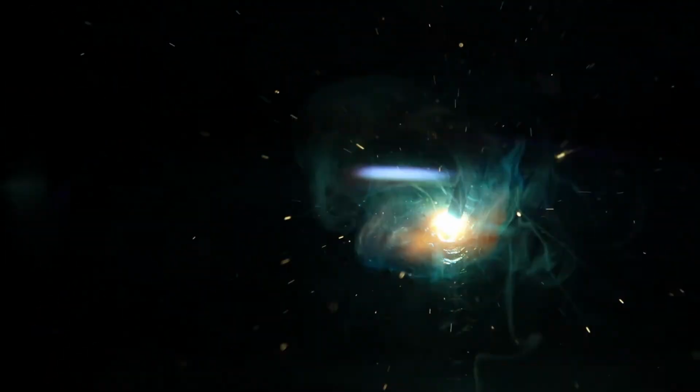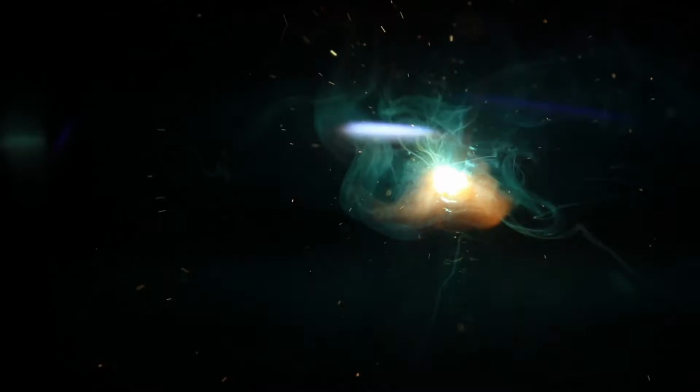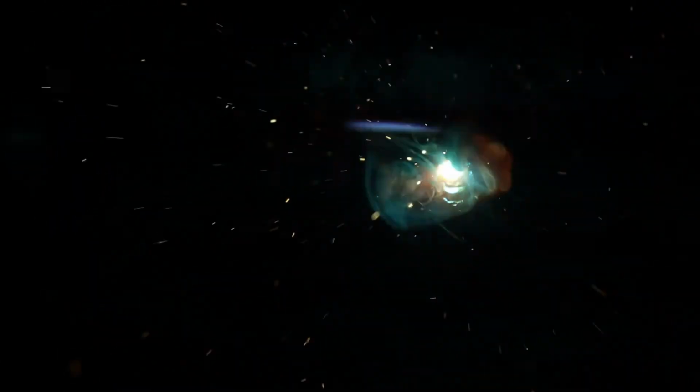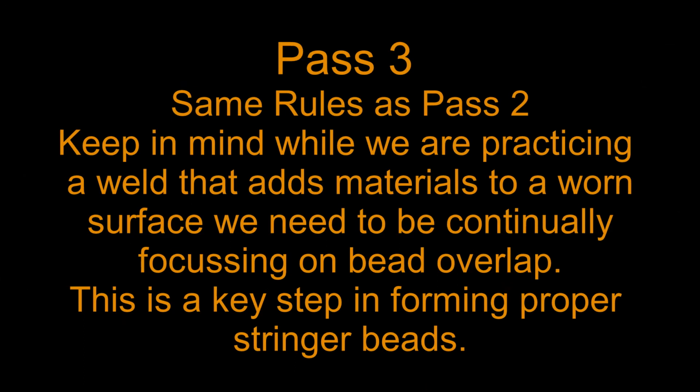Notice that the electrode again is covering about 50% of the previous pass. This little alternating current machine, we had some, not difficulty with it, but we were really pushing the capabilities of that machine as far as the duty cycle goes. And you'll notice as we get towards the end, we struggle with it a little more. Something to think about when you're looking at a power source: is it going to be able to handle everything I want? Again, we're welding with a $75 machine here.